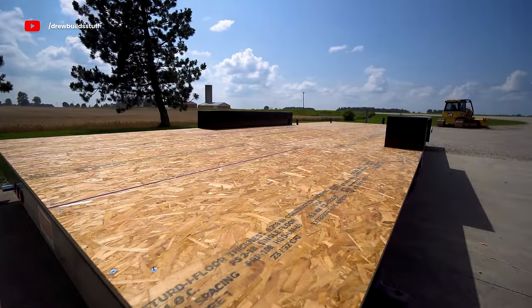With the J-trim installed along the bottom of an entire wall, I'd just take a 3/16 inch drill bit and drill some weep holes every 18 inches or so. The siding panels need trim on every single edge, so I'm also trimming up around the top here. And again, this is going to use the exact same concepts that I'm going to show you trimming out a window in a minute or two, or three or five.